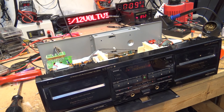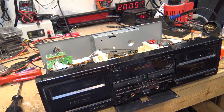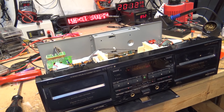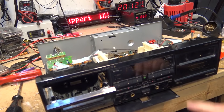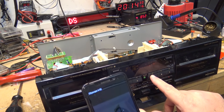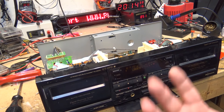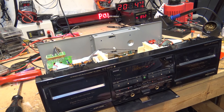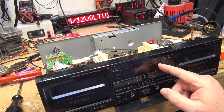This has got dark glass — I wish it had lights in there so you could see the tape. That's one thing I'd miss on some tape decks; some of them had lights behind them. That's what they should have put on this, especially for the kind of money they charged for these decks. Okay, that's the third track. I'm going to do one more track in the reverse direction on the other deck so I can test the auto music search — four tracks in total. I've got my track queued up, hit record, hit reverse, and play. On the display, there's a counter mode and a time mode. In time mode it always counts forward — this is your actual recording time, so if you've got 45 minutes per side you can keep track of when you're getting close to the end. It's a cool feature.